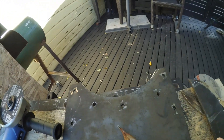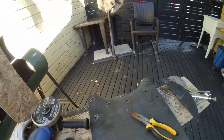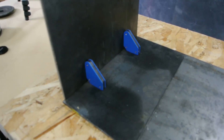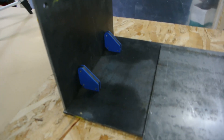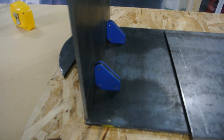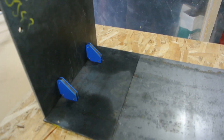I traced it all out, lined up all the bolts, traced with a Sharpie, and now I'm going to take the mini grinder with a zip cut and cut this out — cut a half moon shape through the quarter-inch plate. Take your time and make sure you use a good quality cutting disc. Working on the firebox now. This is the plate that I've drilled all the holes in — it'll bolt onto the actual smoker. Quarter-inch plate, nice and solid. Now I'm squaring up the box, going to tack weld it using these helpful magnets and then weld it all together.